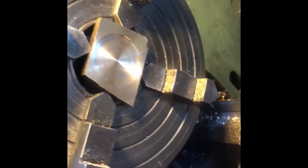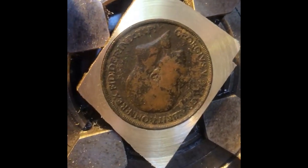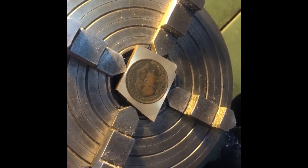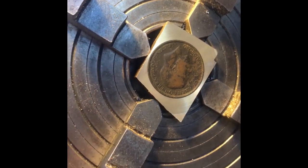Let's check that. Beautiful — feels flush, no movement. That is a nice fit. The machining technique is good. I have to practice everything first of all because I've only got one piece of hex stock to make the lighter out of, so I'd better not get it wrong. But that feels like a good fit. We'll try soldering it next and see how that goes.